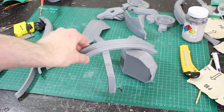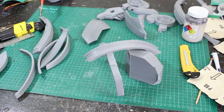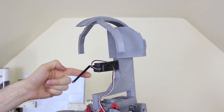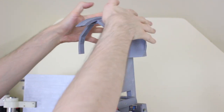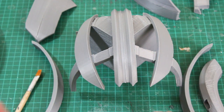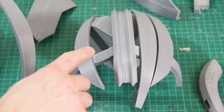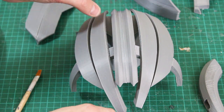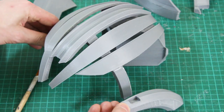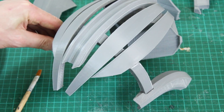Here are some of the other parts — this one is my Alice band and the back of the head. Let's see where that fits on actual Ultron — it fits right back on the original stick. There's his jaw servo and the jaw pivot point, so now we can put some of the panels on and start building the head out. I've started to solvent weld these on — they're stuck with acetone because everything is printed in ABS. I've made little keys in everything so they all slot together nicely and everything fits together. These pieces have holes in that plug in there, so it should be really easy to assemble with everything in the right place.